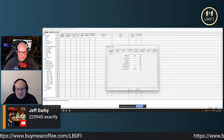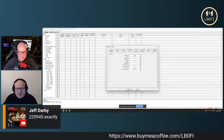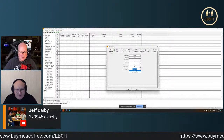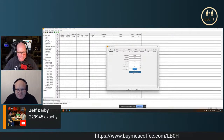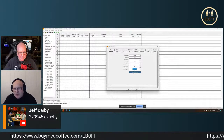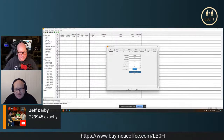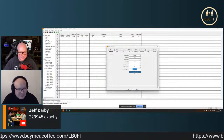There is an interesting part here which is called amateur mode. You're under work mode, and this took me a while to find out what it is. In amateur mode, you can program the radio via the keypad. If you put it into professional mode, you can make it send on any frequency. So you can do, for example, hunting radios or add other professional radios, but you can't program it via the keypad. So this one will bypass the protections for frequencies.